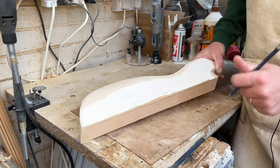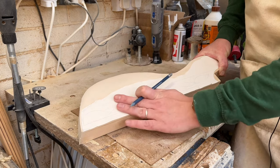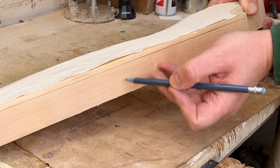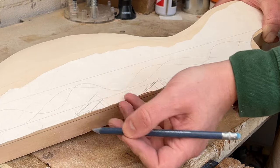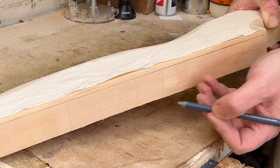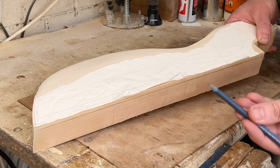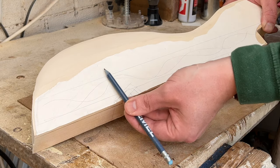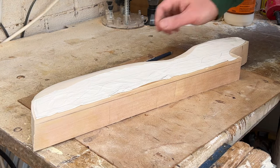For drilling holes in here, I'm going to have a carved area like a Celtic rope design that's then going to be resined flat. I've decided that's going to go that deep, so I can't drill any holes anywhere near that line. I've got this gap - I can put a hole probably that kind of size along here. I've also marked off where the pickups are going so I can go down there without interrupting those spaces. Because of this carving I've got a limit to how far in I can go, so once I've picked my drill bit I've got pretty much that depth all the way across.